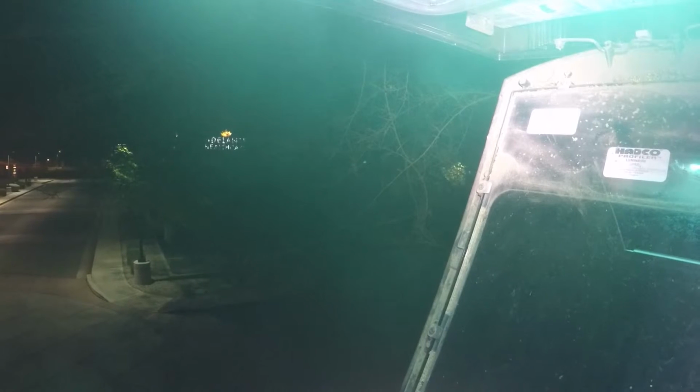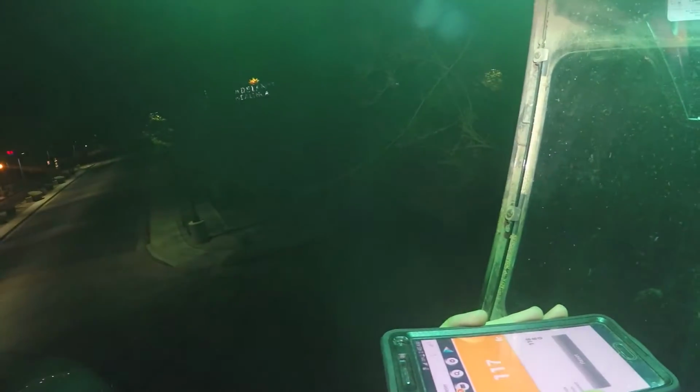What I basically look for is make sure that the brightness continues to rise. Sometimes it'll stall out and you'll just get a blue color from the bulb. That's a sign that the capacitor is bad. It's usually a little slow to start, but then it should start ramping up and increasing rather quickly, like right there. Just jumped from 90 to 100 to 120. So it looks like this capacitor is good.